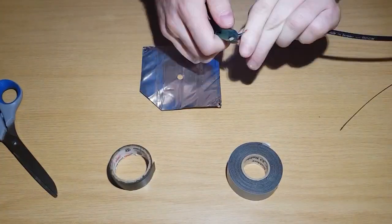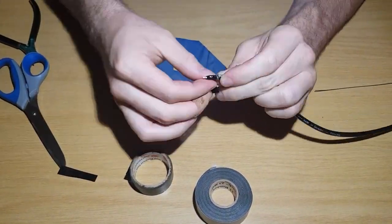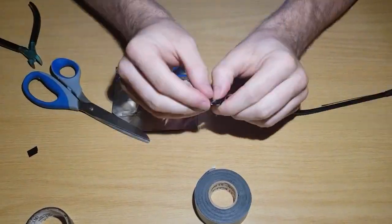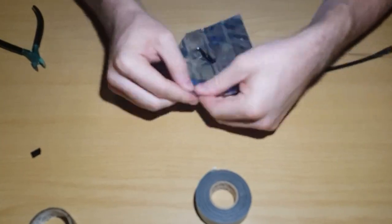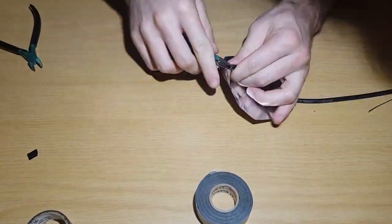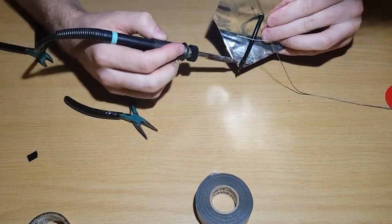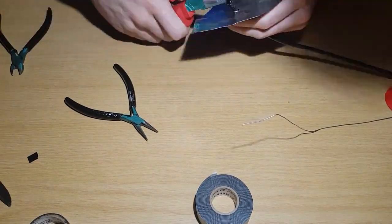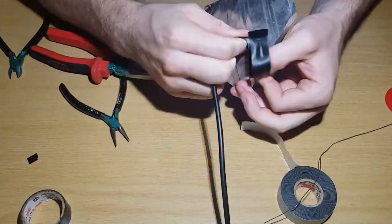Now it's time to bring it all together. A small piece of insulation tape is placed around the inner sheath to prevent heat damage and shorting from the soldering. The plates are then pre-soldered, and the cable is pushed through the centre hole. The inner sheath is then pushed through the 5mm hole. The shield wires are then soldered onto this leaf. This leaf is then folded, and rubberising tape is added to the back for support.